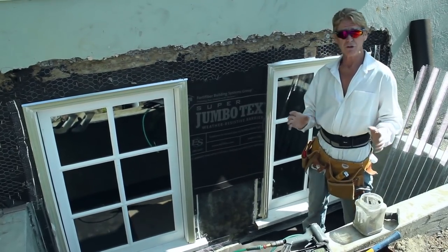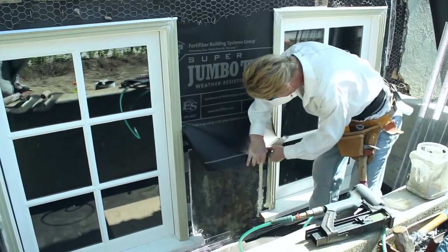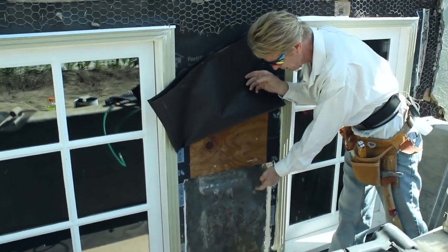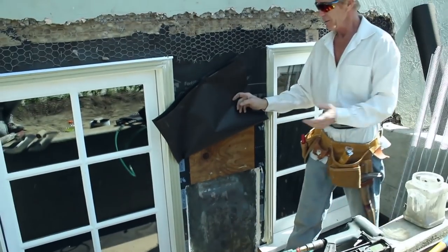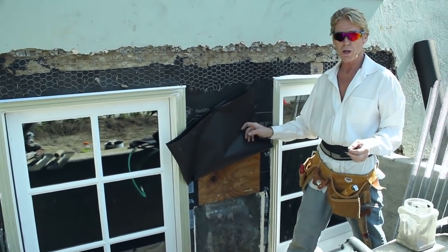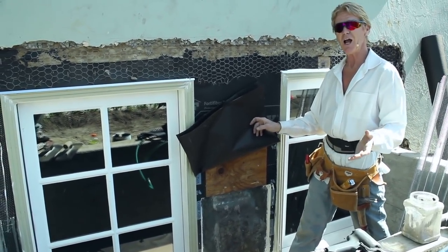The question is: do you need paper? I'll show you guys something that a lot of folks always ask me about. I'm going to lift up this two-ply — this is two layers of paper. Now we have plywood, then we have concrete here. And the question is, do you need paper to cover concrete if you're going to stucco it? No. In fact, you couldn't do paper over concrete, cinder block, brick, or any other cementitious substrate if you tried.